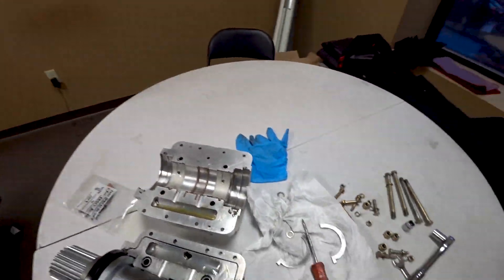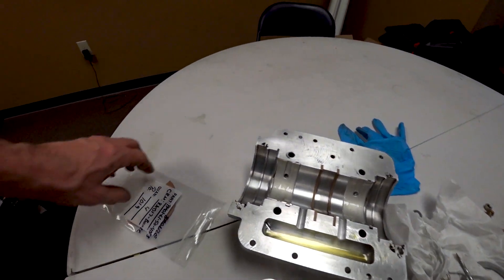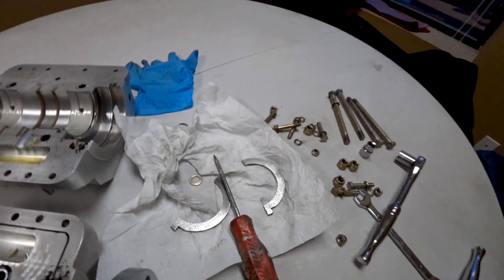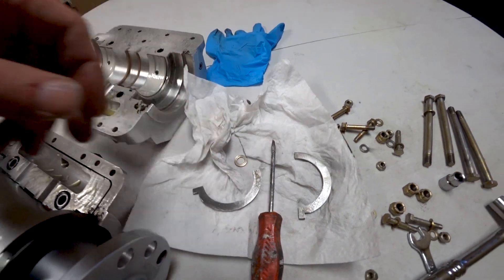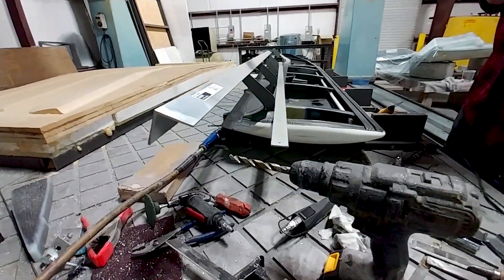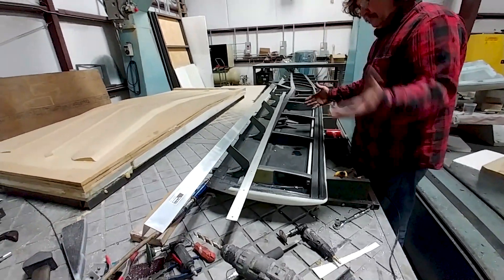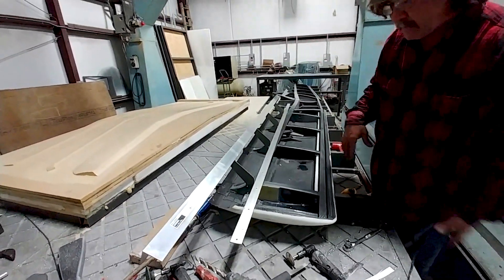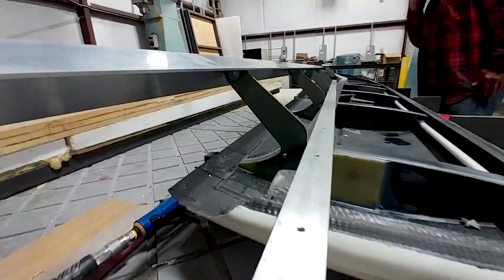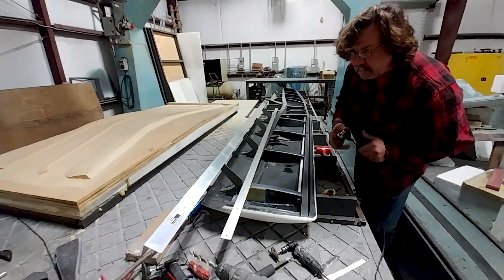With it apart, two of the new bronze rings are already installed and two more are ready to go. I had to sand the inside of them slightly because of a rough textured finish that was causing them to jam. Meanwhile Jeff is aligning the hangers using aluminum L-angle, making sure they're all aligned before drilling the third bolt hole. Yesterday he also bonded an extra flange on the tail edge of the fuselage for the cowling to mate up to.